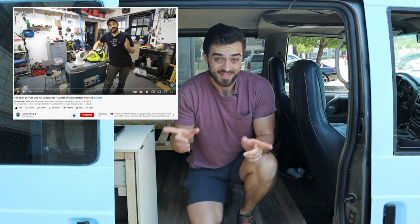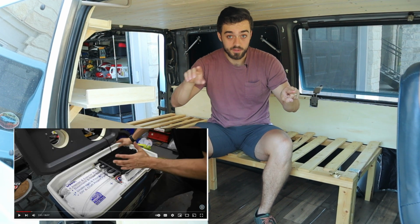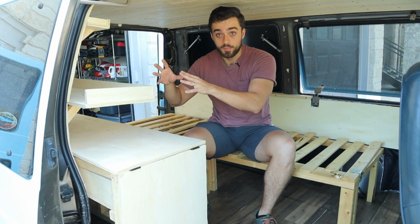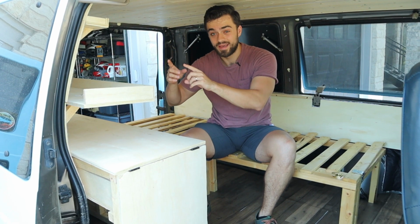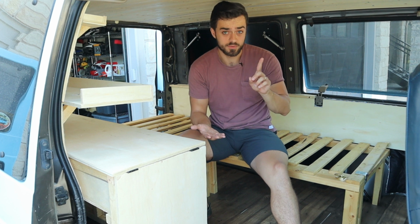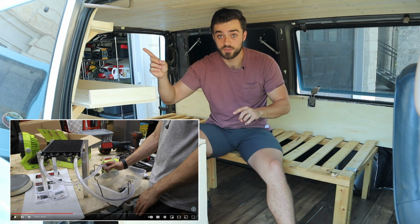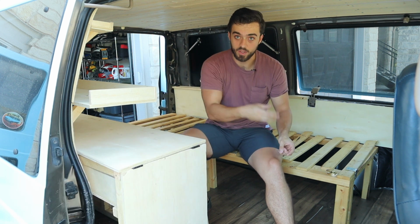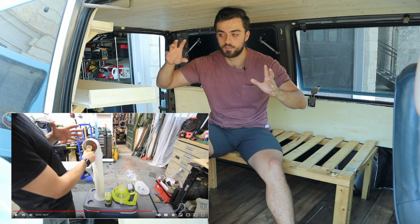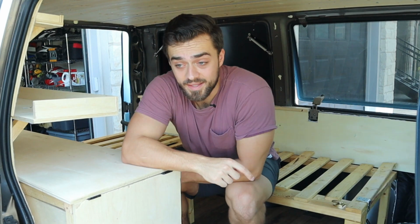There's a fella on a YouTube channel called Make Everything, who basically created an upgraded version of that idea. He got a cooler, he put ice in it, and what was very innovative was that he put insulation right in the middle of the cooler, or a little higher, and above that he put a radiator or an oil cooler and ran lines down into the cooler. And in that space below, he has an open system with a submersible pump that basically pumps water from that lower level into the upper level, into the radiator, and then back into the lower level, just dumping that water back into the lower level. And then on top level, he has that fan idea, blowing air into the fins of the radiator, ultimately creating an AC system that lasts about all night. And the only energy it's using is the fan and the pump, so it's significantly less.